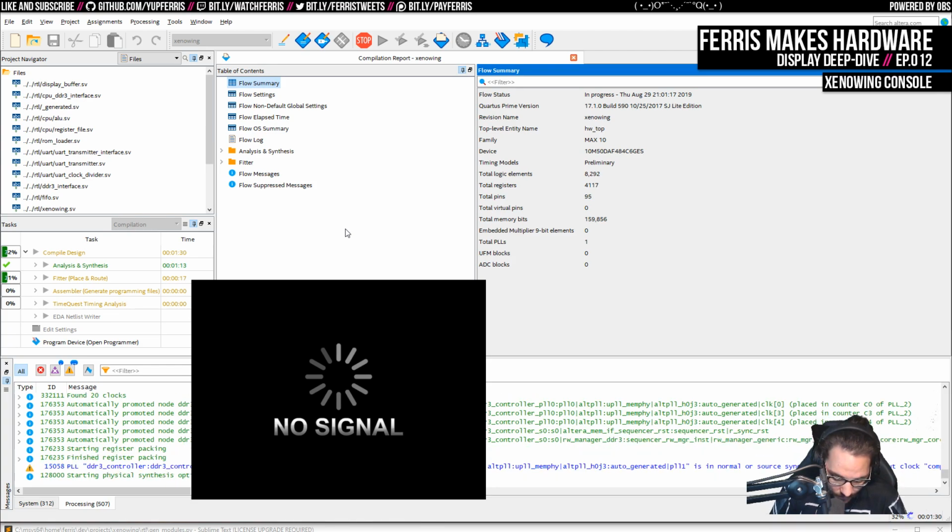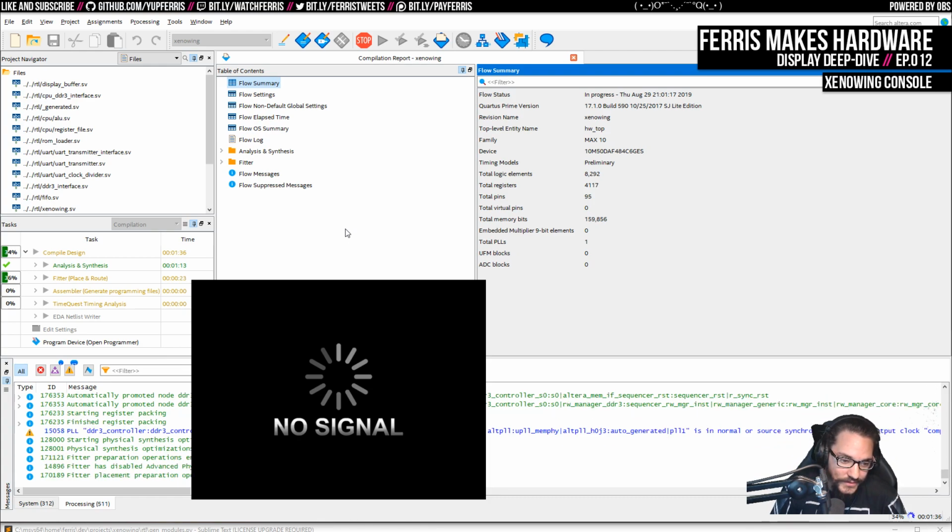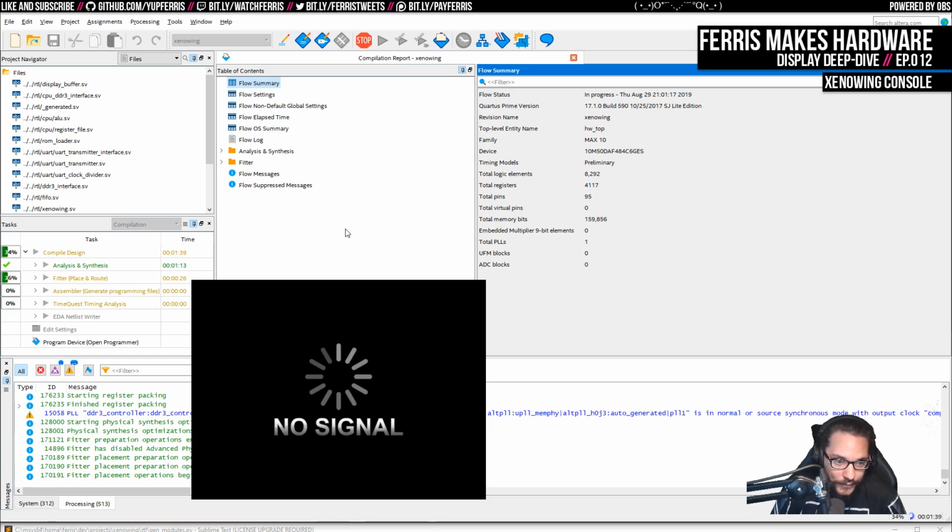But I should definitely go through that where I update Quartus, update the IP. See if I can kind of recreate that initial DDR3 test on its own that I had before, but with a newer version of that controller, and again with the same timings for my board, and see if I still get errors there. If I don't, then migrate all those changes into this project. Even if I have to rebuild all the top level stuff, I don't really care. Most of it's just pin assignments anyway, to be honest. And that's all textual in the Quartus file, so I could kind of plow my way through that.